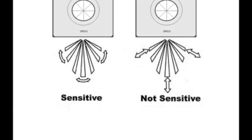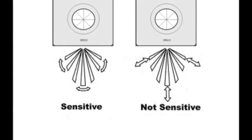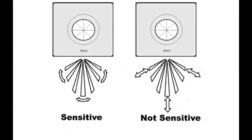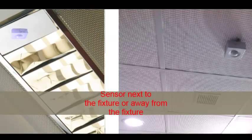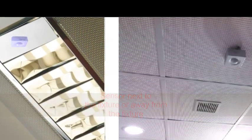Make sure that you carefully study the detection pattern of the sensor provided with the instruction bulletin, since the sensor detects motion across the optics and not towards or away from it. You may place the sensor next to the light fixture or the device that needs to be controlled by the sensor, or away from the fixture.